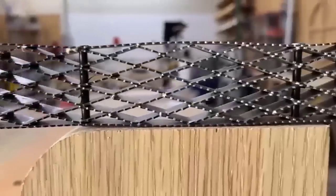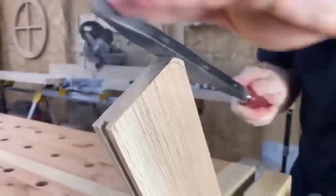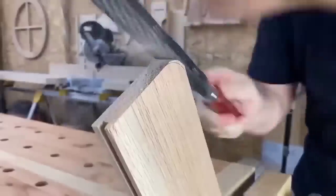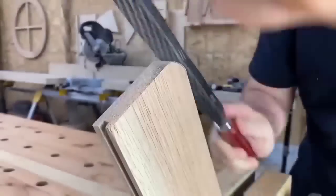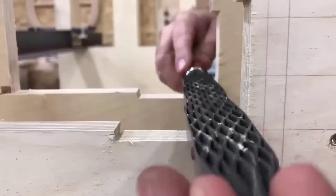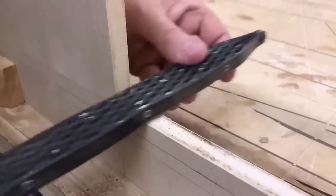The wood rasp is designed primarily for the manufacture of various furniture and products with organic curves. It is a unique tool whose blades consist of several metal blades similar to knives, but with teeth aligned on both edges. The double-sided saw blades of the rasp have coarse teeth on one side and fine teeth on the other. One side is coarse for shaping and rapid removal of large quantities of wood, and the other is for finishing. The teeth are positioned all the way to the edges, which makes working in corners very easy.